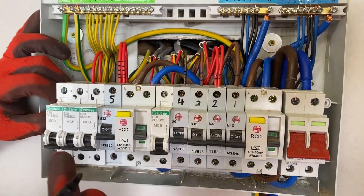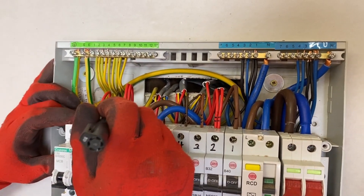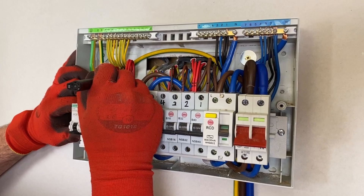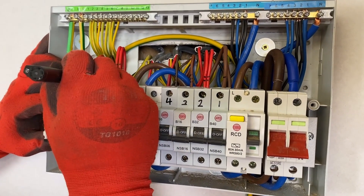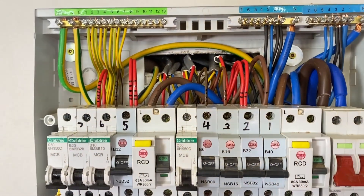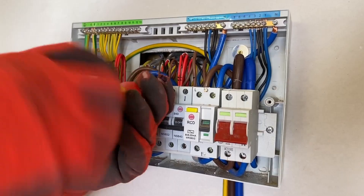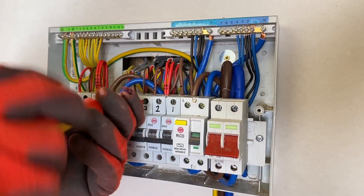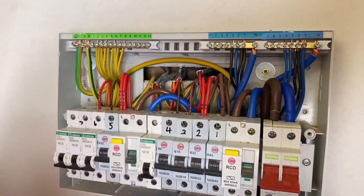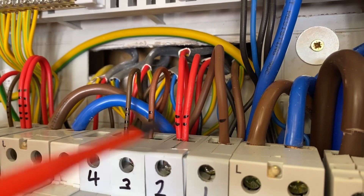How many have you got in here Rick? Seven circuits. So that last one's going to have a few lines on it — you're going to identify the protective bonding conductor to the water with the green and yellow one. So the process of putting marks on is important because we need to arrange them into our extension box. That's fully labelled up and ready for disconnection.